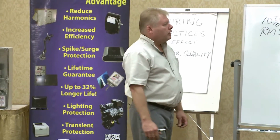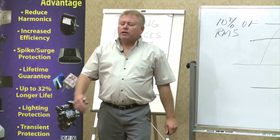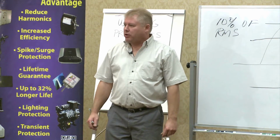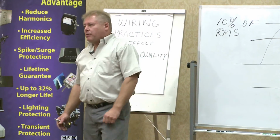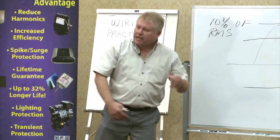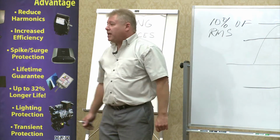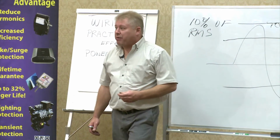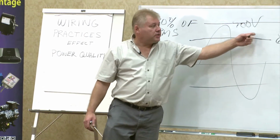Okay? It's very, very difficult. I'm not going to say impossible, but you would have to put in incredible amounts of active power supplies and whatnot to be able to facilitate that, but then they wouldn't last very long either. You're basically taking AC, converting it to DC back to AC, but you still have the AC load on the other side reflecting back anyway. So you would still need something on, excuse me, on the load side of that active power supply anyway. So this is what CleanVolt facilitates, 660 volts.